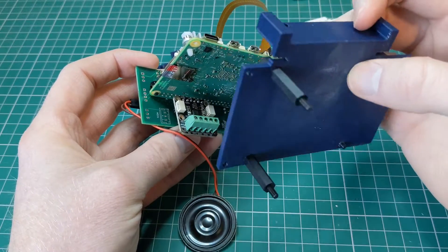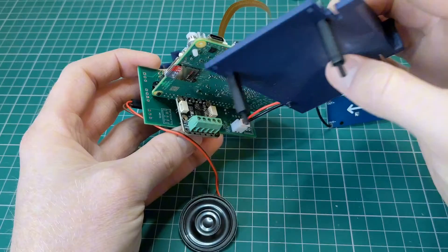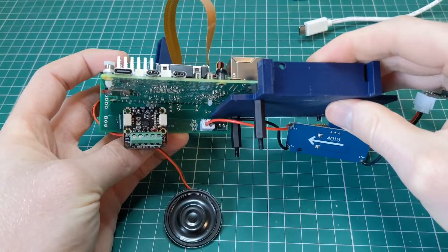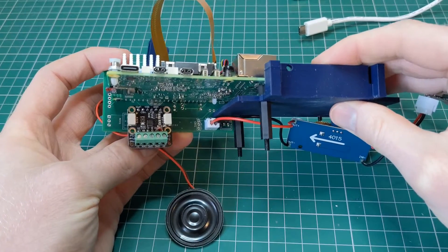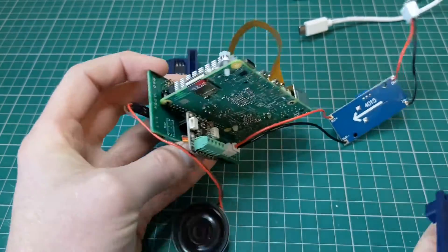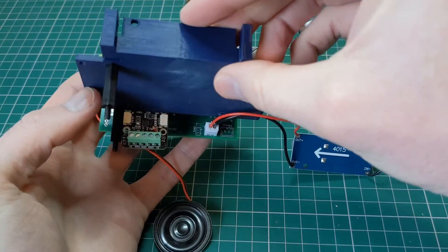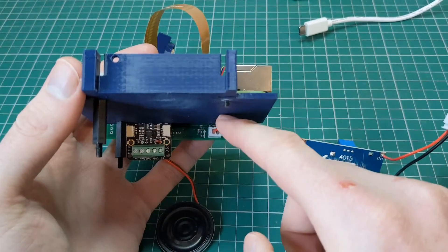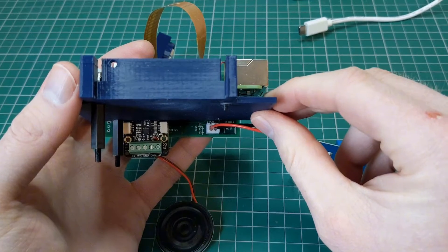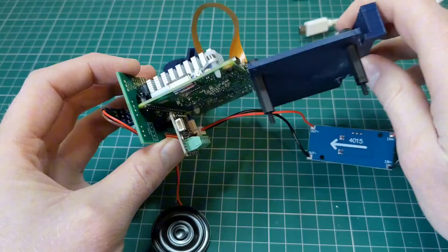I can adjust that by just making room, which wasn't going to be a full sheet in the final version so that's hopefully not going to be too much of a problem. There's a similar height issue around some of these other pins as well, but they're all on the other side of the board so that shouldn't be an issue. I don't want to put this on the other side because it's going to stick out too much and get in the way of the LEDs. The only other problem is that the standoff screws for the legs probably interfere with the power. The most sensible thing to do is just to reprint the 3D print so that the legs are in a slightly different place — so there's a little bit of work to do there.